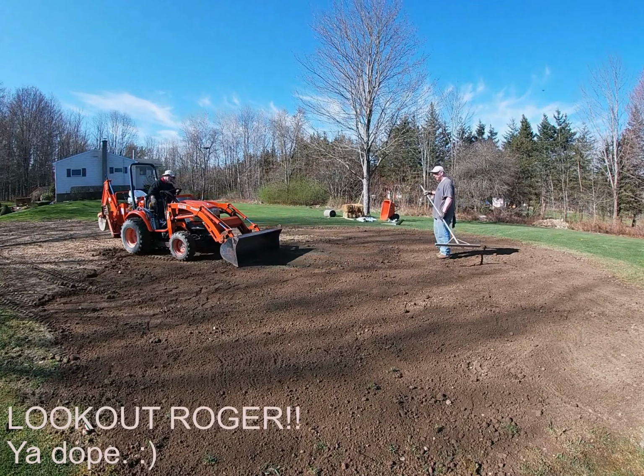He drops the soil, back drags it, and the finish guy gets it to grade. That's fine for where we are right now. That's a good enough grade. When we roll this and take the big rake over it, this will be very nice. So all we're striving for here is pretty fast work. And you get out of breath trying to keep up with the machine, but I'm doing it.